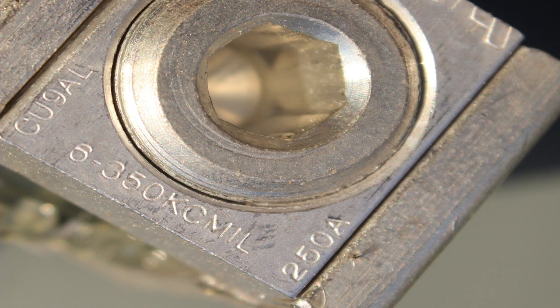I got a comment on one of the streamers on the aluminum for the meter, that somebody might be running larger conductors because it went up to 600 thousand. Oh, I see. We're just telling you the lug is between 6 gauge and, let's go back to that one back here. Victor Amons said that. That makes perfect sense. The fact that it can go up to 350 kcmil.